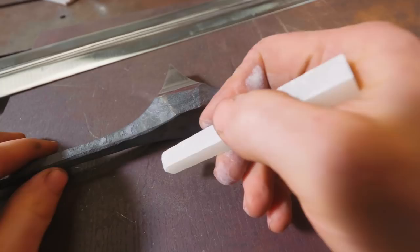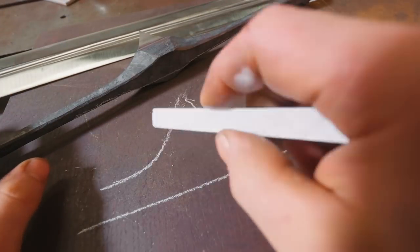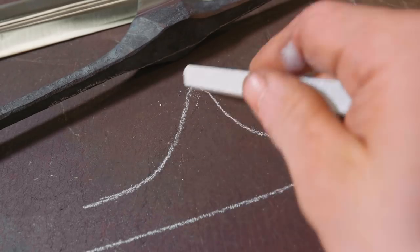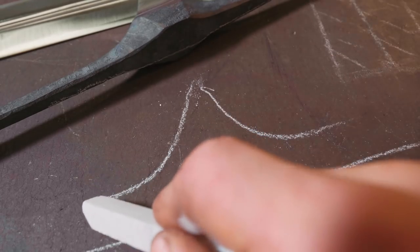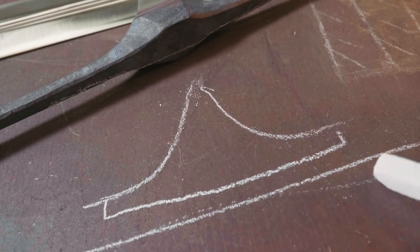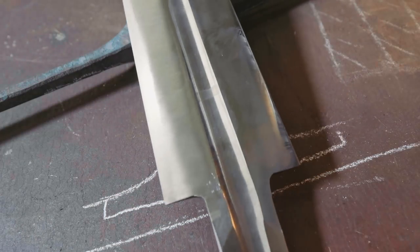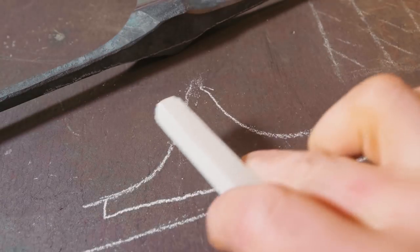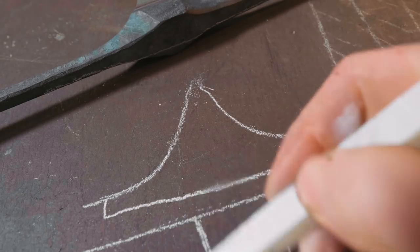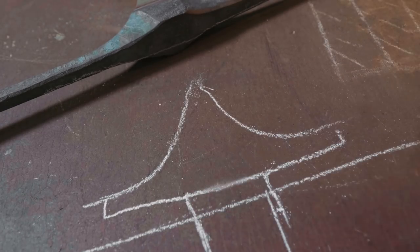Not only that, but if we have a look through with our x-ray vision, imagining we can see through it, we not only need a cut out through this, but it needs to create a pocket halfway down the guard that is flat with the bottom of the guard for that tang to sit into nice and firmly. And then, of course, it needs to be milled to be able to accept the tang's complete passage through the guard right there.